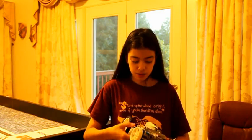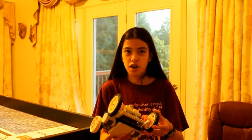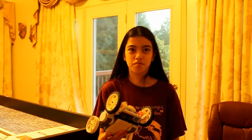To demonstrate the PID algorithm, we programmed a move block to move 2 meters. Watch what happens after I stop the wheel — when I stop this wheel, the other wheel stops too to compensate. And when I let go, the wheels start moving again. It would be preferable to have matched motors so that you wouldn't have to rely on the PID algorithm within the move block, because your robot will be able to naturally drive straight.